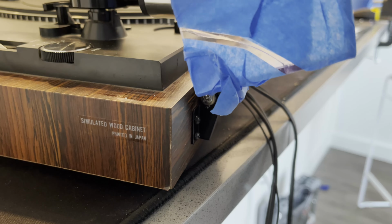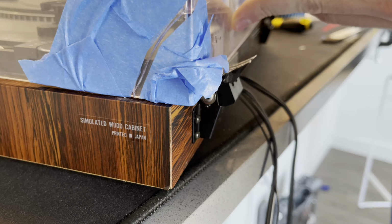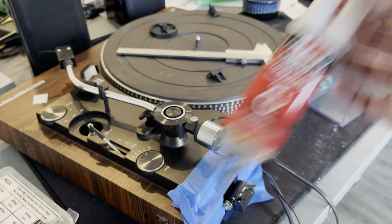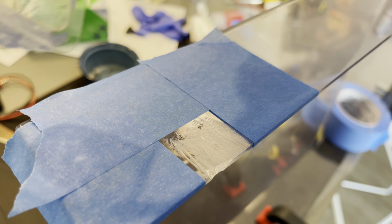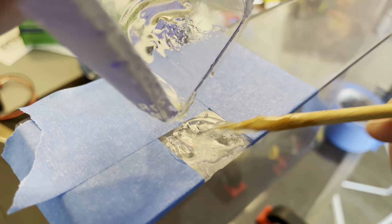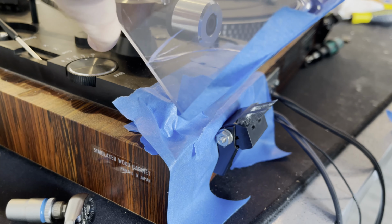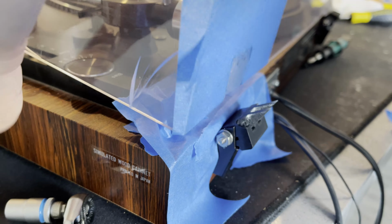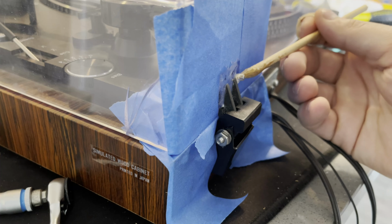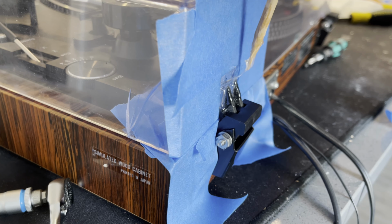So I've got to line up both of these hinges. And putting it down. And the glue didn't hold at all. So not the best glue for acrylic, so next best thing is to use some epoxy, right? So the plan here was to just coat the whole thing in epoxy and just kind of suspend it, because there was a bit of a gap that it still wanted. So I got that epoxy piled up on that little section. And I've removed the springs from the hinges here so it'll stay where you put it. And you can see that gap still, but I figured the epoxy can bridge that pretty well and just completely encase the top parts of those hinges.